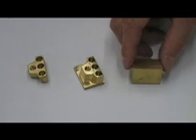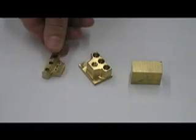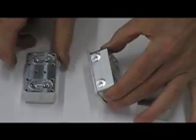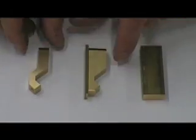These parts were all produced in only two steps. The stock was clamped in a vise allowing all features that could be addressed in the first position to be machined. The parts were then turned over so all remaining features and the stock that was clamped in the vise could be finish machined. This clamped material is often referred to as the carrier.